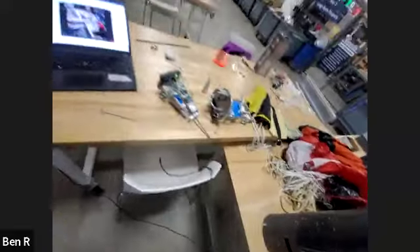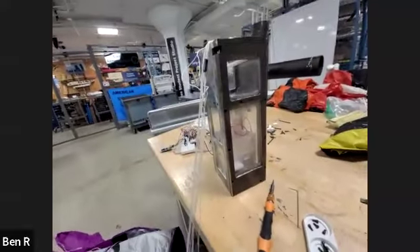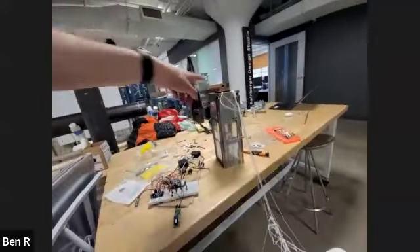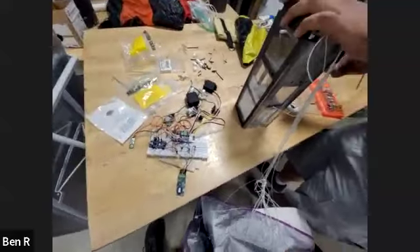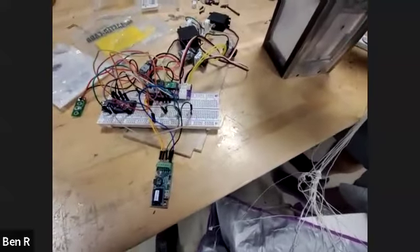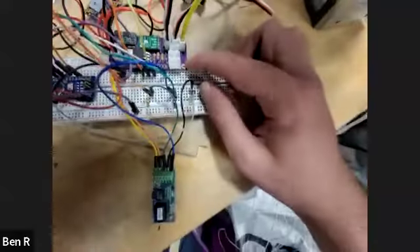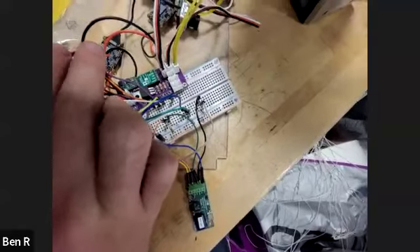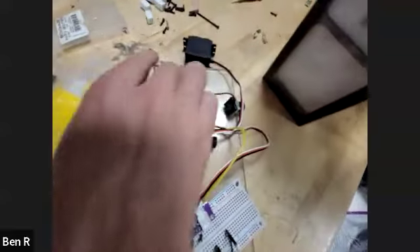The payload is still undergoing electronics testing so we have the breadboard set up right now. We have a Raven 4 in the payload. We were originally planning to use an SRAD flight computer but because of time constraints we weren't able to prioritize that, so we have an SRAD power distribution board with two voltage regulators for the servos, cameras, and our SRAD NiChrome cord cutter — this is the prototype version but the actual one is fabricated.